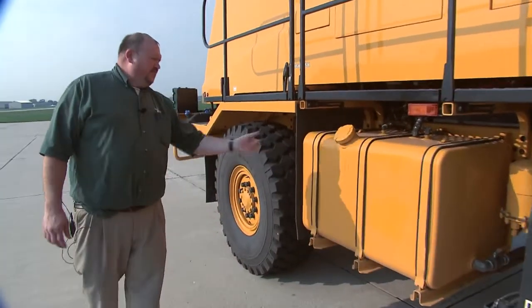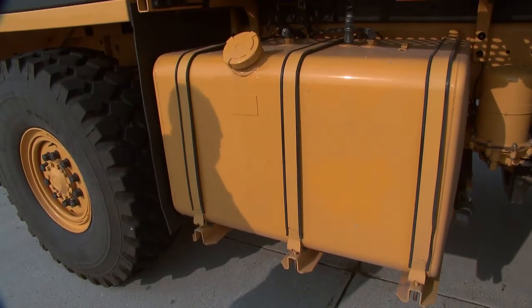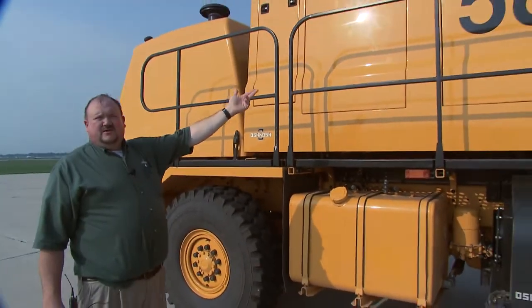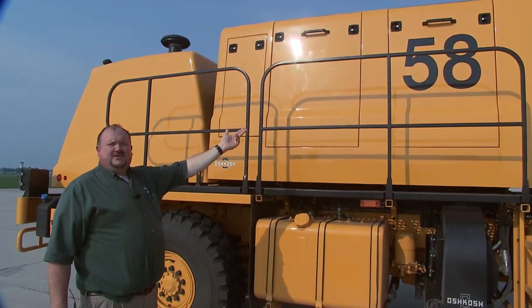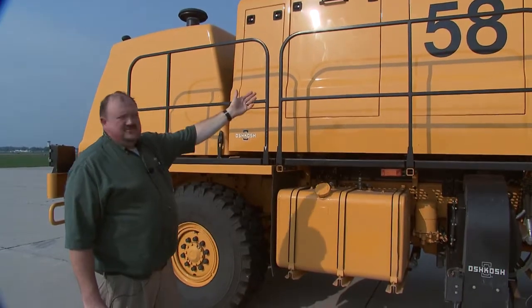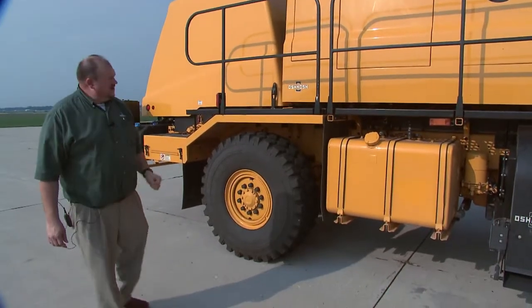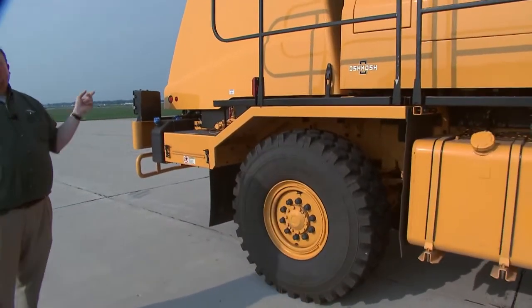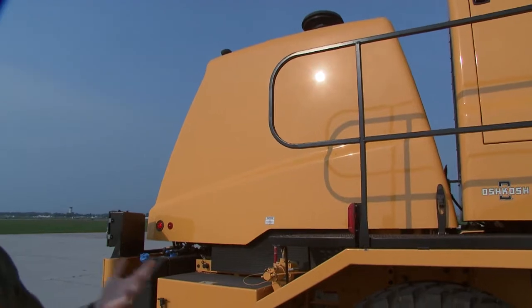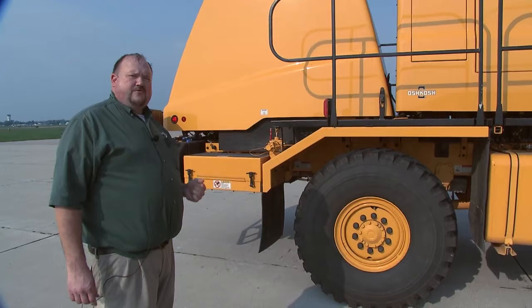Moving further back, we offer 250 gallons of fuel on this platform — a tank on each side, also equipped for single-side fill if you choose. Our broom engines are available in the QSX for Tier 4 initial, and we're moving into the QSG Tier 4 final broom engine. This engine is available from 350 up to 500 horsepower, dedicated to operating the broom head. In the back of the truck we have an ISX 12, the Cummins on-highway engine with 2013 emissions, which will pass emissions control for any on-highway or airport usage situation.